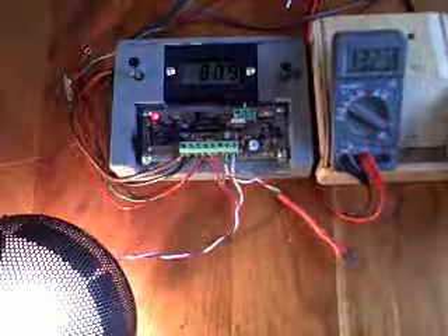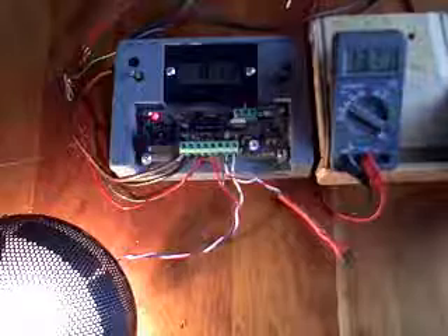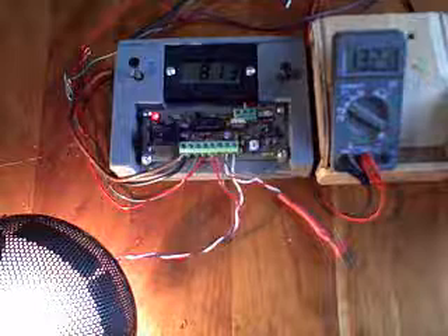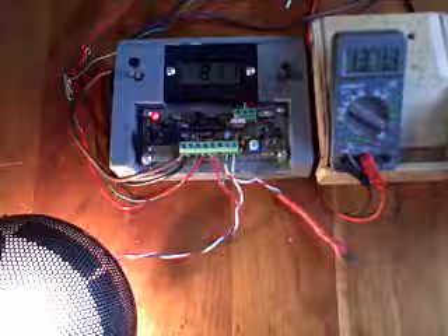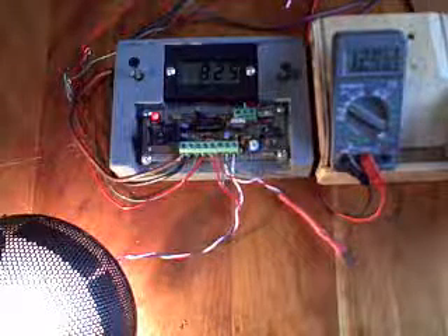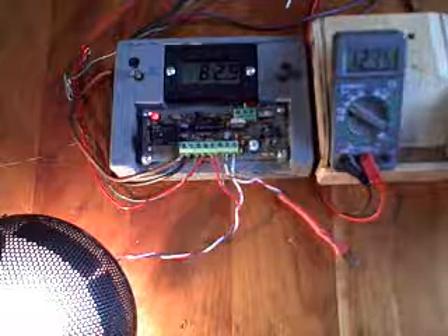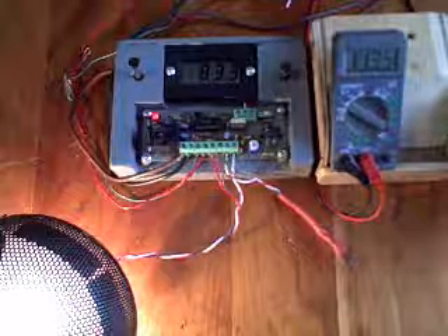The pump is on, and now let's say that the pump is on too long, and the voltage that drives the pump begins to drop because the photovoltaic panel does not have enough current to drive the pump. That's a situation that we really don't want to happen. Let's just assume that the voltage to the pump is dropping. This means that the battery voltage is dropping too. And if the battery voltage drops too low, it could destroy the battery.